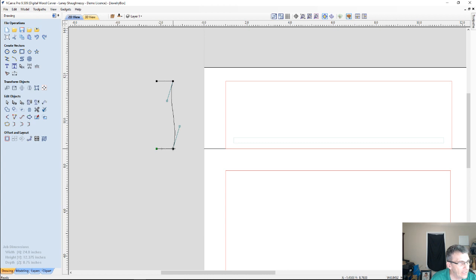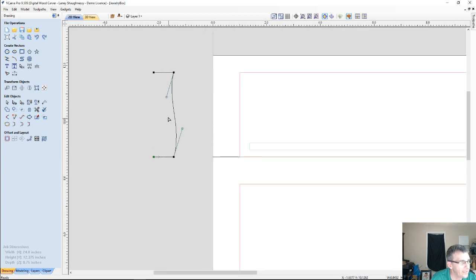What I would like is for the box to be kind of fat at the bottom, and then come in and start to curve in towards the top. I want a nice curve, but I have to be mindful that whatever curvature I'm drawing, I'm changing my part width, because I'm bringing this curve out further. Now if I measured from this point to the widest point out here, I'm more than 3/4, and I'm going to have to make an adjustment if I select this part here, because this is the curve I want, just a very simple, nice gradual curve.